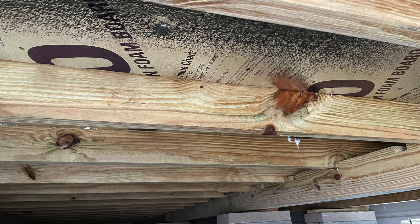So I didn't talk about this earlier, but think about your floor insulation. You can, when you're designing this shed, have them blow in that I think it's closed cell insulation, but it's really expensive. So if you want to do that, there's a couple of different ways. You can raise your shed up high enough to get underneath of it and put the insulation in yourself, or you can do the blown in insulation yourself as well. I think they sell that at the big box companies.